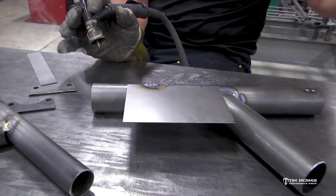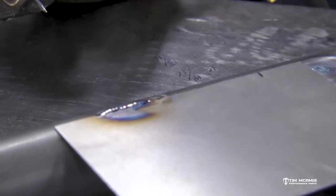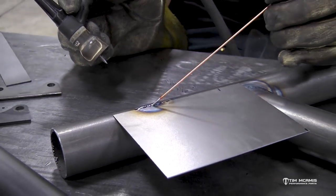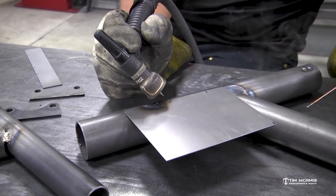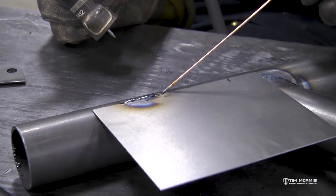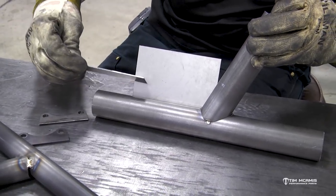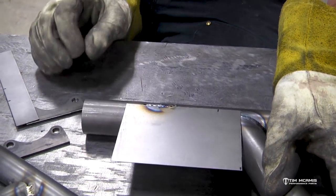I've got a little too big a rod — I just grabbed a 1/16 rod because I had it laying here. I wouldn't normally use that; if I didn't double-break this I'd use an .045 rod because it won't have so much weld content. This is a little too big a rod, but I still got good color to the weld. You can see as I was moving, when I stopped, the argon coverage is kind of shaped like that cup because I was aiming it more down this way. That'll be a nice weld and nice and strong, and then I can come back underneath with that floor strip that's broken at a 90, weld that along here, fit it to the corner, drill those 6-32s in there, and bolt that down — that'll keep the vibration from getting to the edge of the material and cracking it.